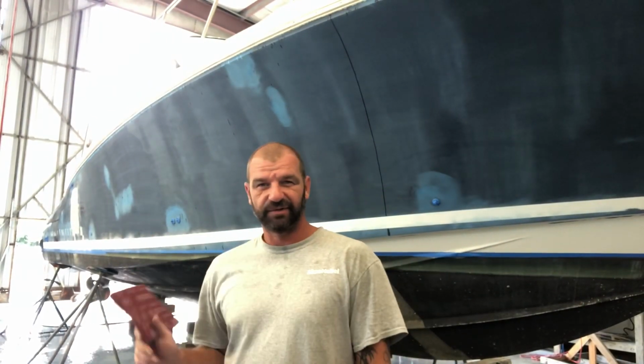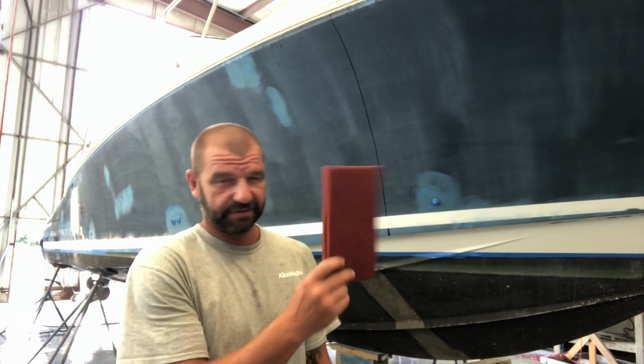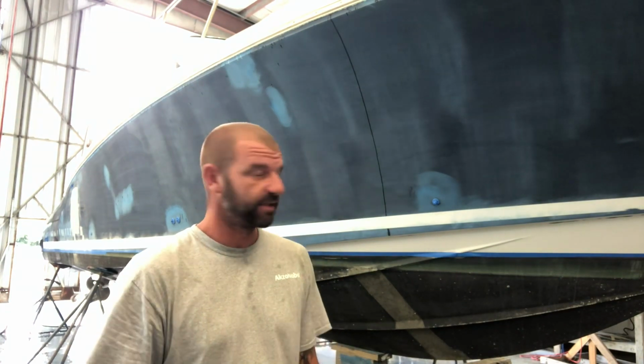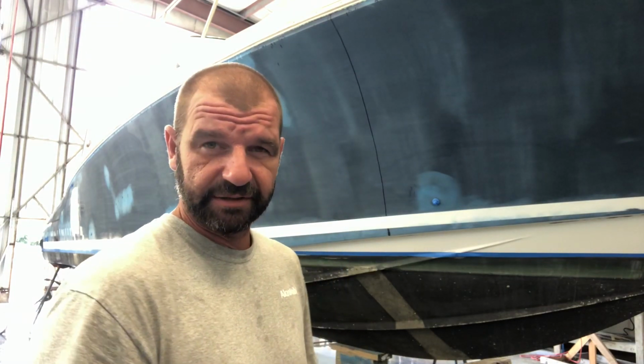All right, later. Okay, everybody. I got all the sanding done, all the glazing and fairing is done, and now I'm gonna wash scrub the boat. I just rinsed the deck off just to get all the dust and whatnot off of there before doing my scrub, but all we're gonna use is Scotch-Brite and a water hose. So I'm gonna go ahead and get the scrubbing.